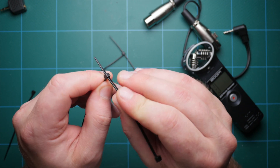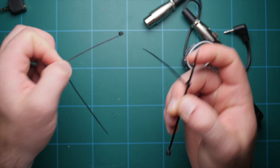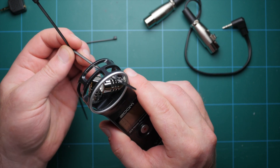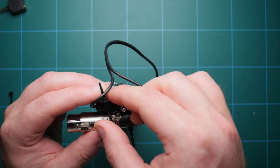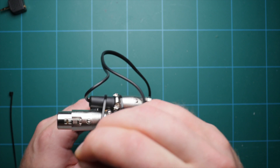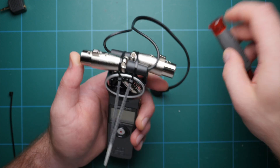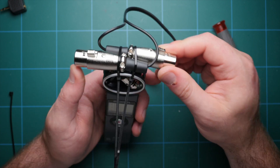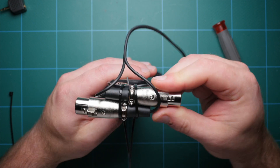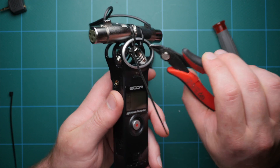The first step is to create two longer zip ties by joining two zip ties together, giving us two longer straps. Next, run the zip ties through the microphone guards on the top of the H1 recorder. We're going to be strapping down the two XLRs facing away from each other on top of the recorder. This can be pretty finicky so just take your time and be patient. Once you get the position right, double check the tightness of the screws on the XLR jacks — the ones I received were pretty loose, so tightening them will add a lot more rigidity. If you're happy with placement and the XLRs are facing straight, snug up the zip ties and clip off the excess.